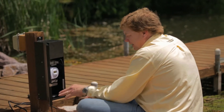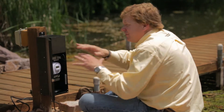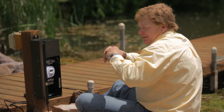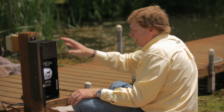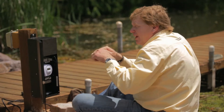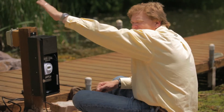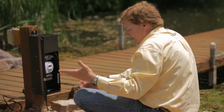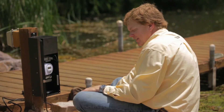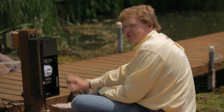It also has what we call a multi-tap setting. With a Universal Series transformer, you're going to want this if you're going to have lights further distances out from the transformer — in your front yard, backyard, and all over your property. The multi-tap setting lets you have the voltage or pressure higher for lights in the front yard if the transformer is mounted in the backyard, or on the 12-volt setting if the lights are going to be real close. You get the ability to control the pressure or voltage going out to the individual lights with the Universal Series.